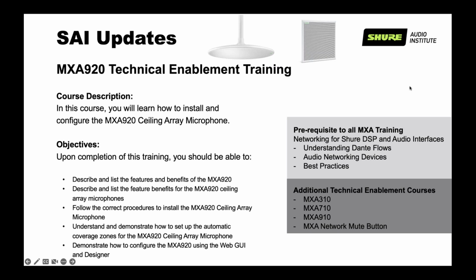Now that's an important qualifier. Make sure that it's a PoE plus switch, not a PoE regular. The difference there is 15 watts versus 30 watts. You want to make sure that you're giving it the power that it needs. And I think the N uses 20 something. Yeah. So it won't work on a PoE. It's got to be a PoE plus. The point there again is that all of our Luxul switches that we're carrying at Audio Video Export, they're all PoE plus. I know there's a little bit of shortage on some of them, but we've got solutions for you guys.